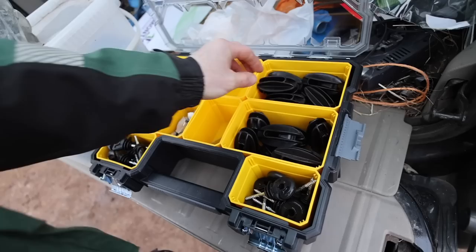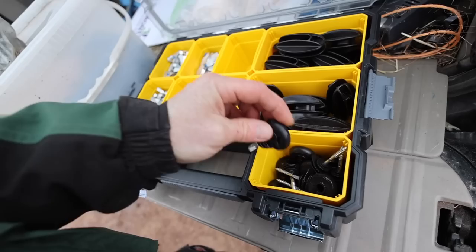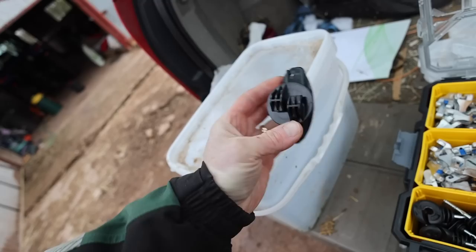Lots of ways to do things but these are a nice easy way to go. So these are the insulators that go on when we strain out the plain wire, because I'm going to electrify our top plain wire, so those go on the end of each one. These are your normal standard ones which we won't be using today, but I've put them on posts all over the farm to put more polywire along. These are the little W-clips that go onto our posts and then our high tensile wire goes through and is electrified.